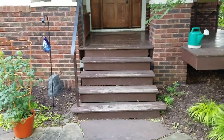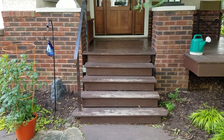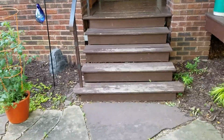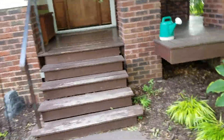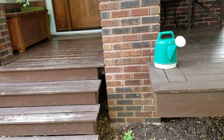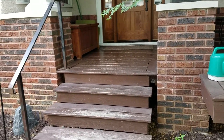The customer is looking to have his wood deck steps replaced with some slab steps. Currently they're about four feet seven inches wide — the top three are that width, while the bottom one is actually wider. He's fine with four-foot steps, so we'll need to first block up the backside, since it's next to a porch, to keep everything enclosed.